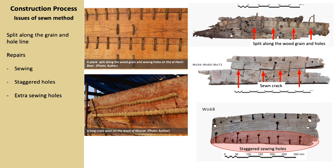These projects also provide interesting insight into the most common issues that medieval shipwrights dealt with during the construction of these sewn vessels. Experimenting with different types of wood showed one of the main risks of sewn plank construction: the timber would sometimes split along the line of the sewing holes. This issue is particularly evident in timbers with fine straight grain, such as teak. Perhaps the staggered holes and sometimes confusing hole patterns of many of the Al-Balid timbers might indicate the shipwright's attempt to prevent this issue. The experimental approach combined with ethnographic analogies also provided insights into how boat builders dealt with cracks and timber imperfections. One plank from Al-Balid shows that boat builders repaired a large crack by sewing it, in the same way done by the rope workers of the Jewel of Muscat. Additionally, many Al-Balid timbers show additional holes drilled next to the sewing holes to reinforce the sewing.